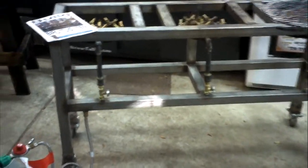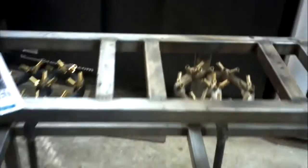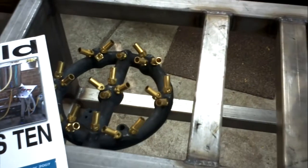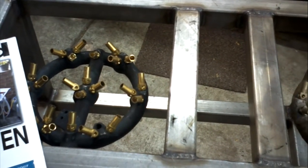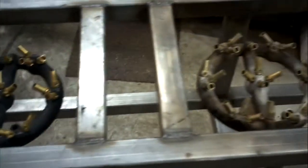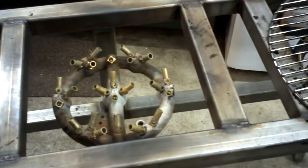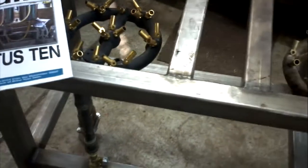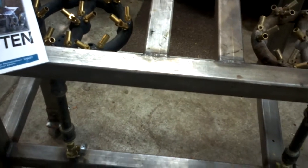It was welded up by a gentleman we work with, and he did a very good job. Everything is smooth, very professionally done, looks great. The burners on this are the 23 tip burners that you can purchase. We purchased from InstaWares. The BTU rating, I think, on these is like 160,000. It'll work fine. We don't have any issues. These have all been used. None of them leak. The main reason for these burners was they have the common 1/2-inch input, which made buying the pipe easier.